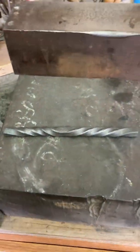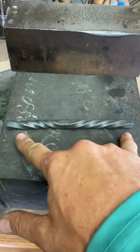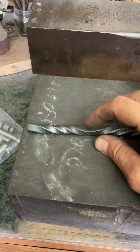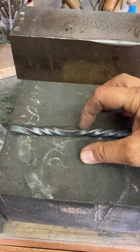Anyhow, simple trick guys, easy to make. Getting it even is a bit of a trick. The first one I did is a little crooked — I'll show you the first mess up. Here it is. That is a little slower twist than it is here. What happened is I had it in my fixture but I didn't put my crescent in the center of the deal. So as I turned, I turned the same amount of times but it made this one tighter than it made that one. So what I would do is with my bandsaw cut right here and then cut right there and weld them up and away you go, if they're centered up with the same twist rate.